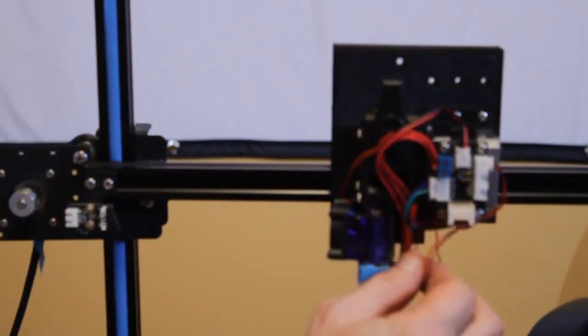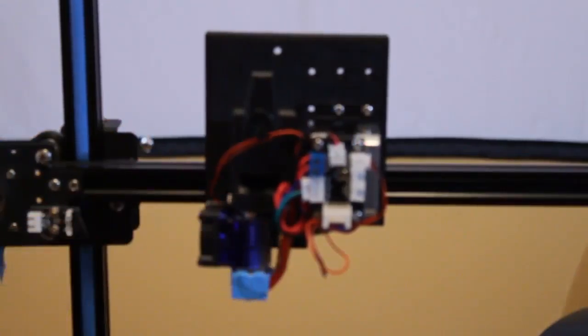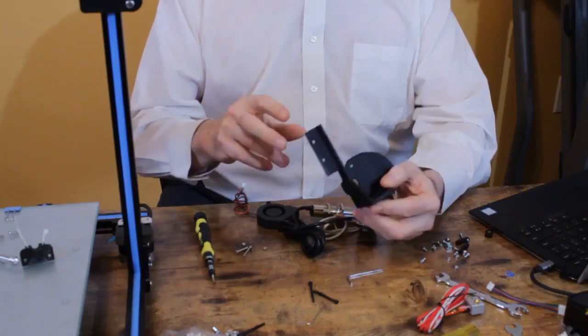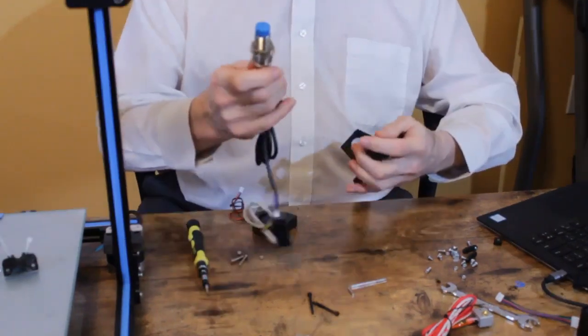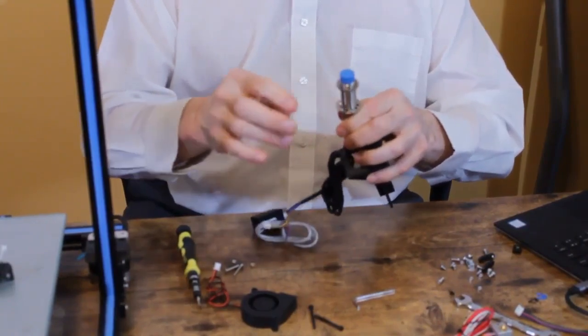As I said, you can do your wire management however you like. And there you go. All right, so the next item we have to install is the bracket that holds the part cooling fan and the sensor. You take the leveling sensor, you unscrew the bottom nut,